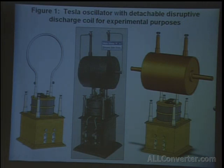And basically, there was a piece of steel on the end of a piece of copper. And there was a tungsten contact mounted. And as the coil was energized, it would simply pull this down and break the circuit. And since the tungsten contacts would separate, the circuit would become dead. But the magnetism in the coil still was there.